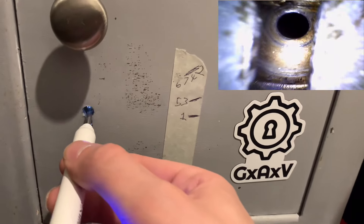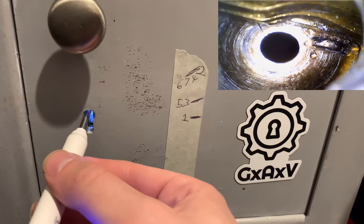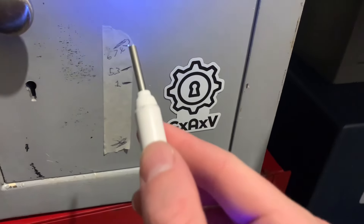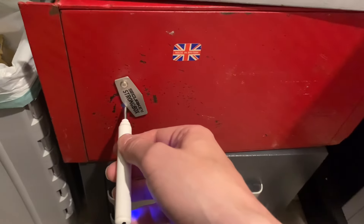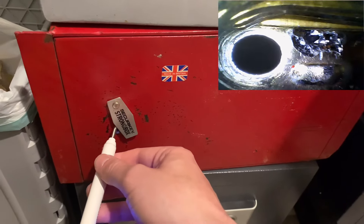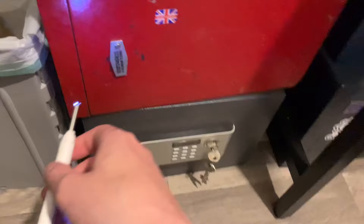I can see in here - that little notch there on the right hand side would suggest that's key retaining. You can see we've got these brass levers up above. I don't think there's any notches. So the fact that I've picked it before in the four positions means it's Lowe & Fletcher. We'll move this aside and go in here - straight away you can see I've modified it. There was a key retaining notch in there and I've ground it off with the magic bar so that I could use it for training. People wouldn't get the pick stuck in the lock, which is handy because with that one you couldn't actually get it out afterwards - you'd have to pick it back closed.